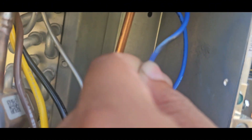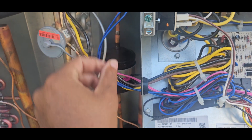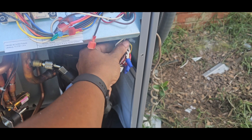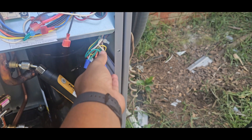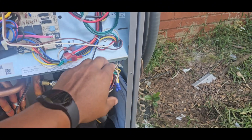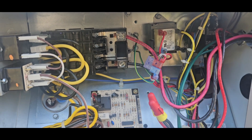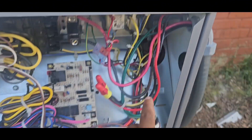I've had a couple of those defrost wires give me rub-outs. I pulled this one off because you can see a little bit of charring — it was rubbing up against this plate, just shoved right up against it. I had to pull it off and added a zip tie to back it off. Also, on these ICP units there's a little plate where you can stuff the thermostat wires. People give a lot of slack in the thermostat wires, they bunch up, and when somebody puts a screw through there it hits a wire and causes a low-voltage short during certain modes. I eliminate that on startups by removing that plate entirely — I removed it on both units.